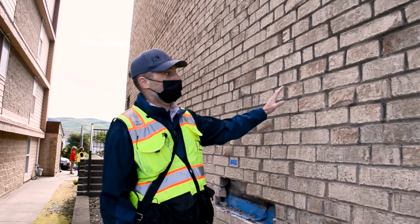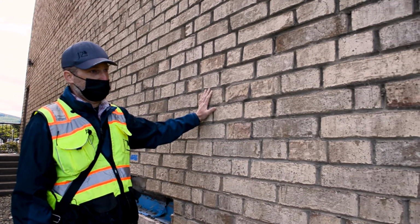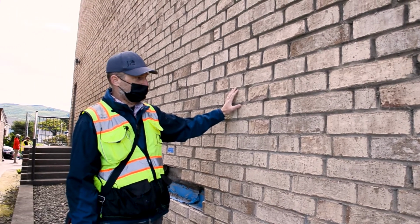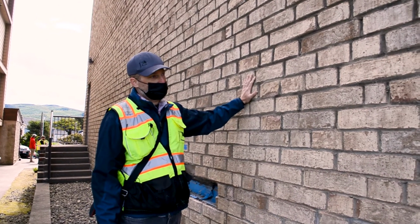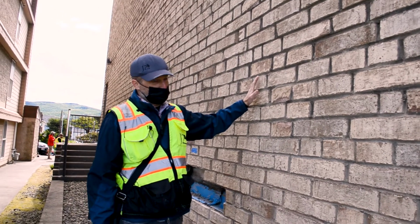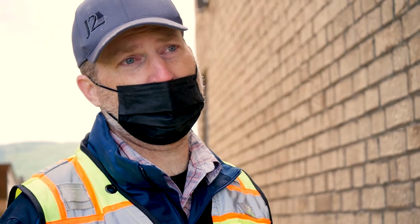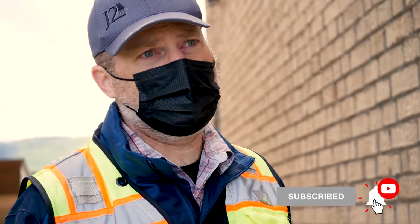And then you could coat this wall and make this the waterproofing, and that kind of kills two birds with one stone, in that you can take care of the waterproofing on the surface. Not ideal, but it would work. And then you could add anchorage to the wall, but you still have the detailing problem of no expansion joints. So you're still going to get expansion and contraction, and most likely fail somewhere and start to get cracks.